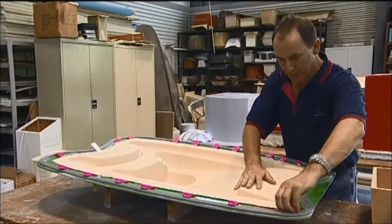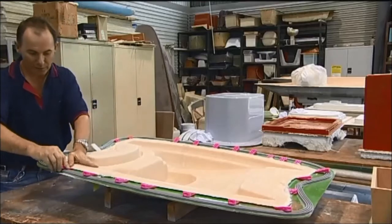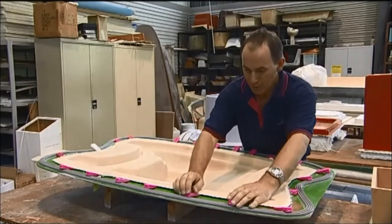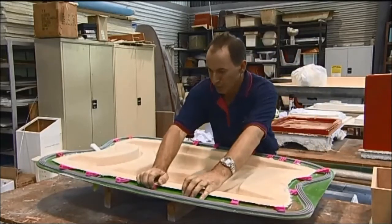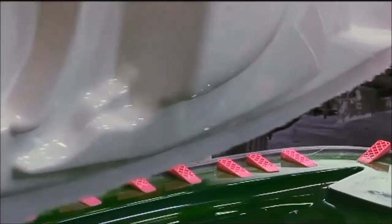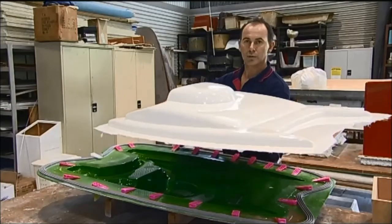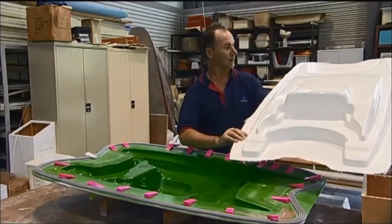As you can hear, she's starting to come away as we go around, and the part is starting to come off with the last few wedges, and we see it releasing. Just put a bit more pressure under, and then the part comes away. You can see the nice gel-coated surface, and a really good weight with the infusion process — around about 40% resin content. And there we have the part ready for trimming and completed.